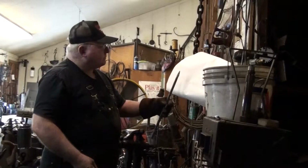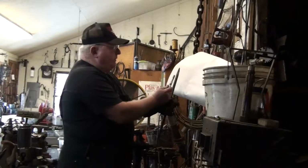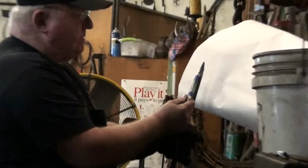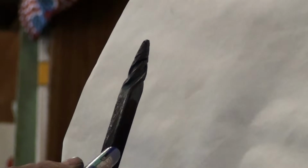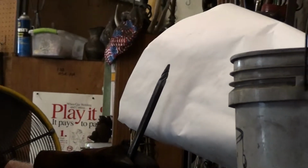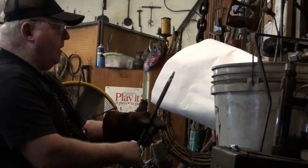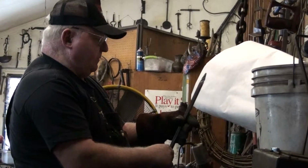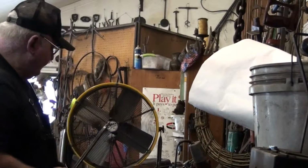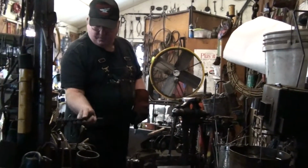On the neck step, what I want to do is I want to fuller this below the beginning of the twist to neck off the base of the bud right just above where the sepal would be. And we'll do that again with torch heat. I'll heat about a 1/2 inch length fairly evenly if possible, and then use a Hardy gate fuller, which I don't use very often. If I were going to do a production piece of work, I'd move quickly to the power hammer for all of that sort of thing. But for this test, we'll be using this old tool.